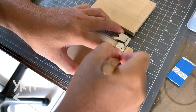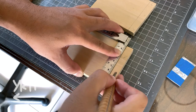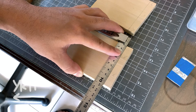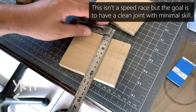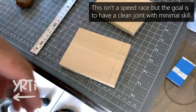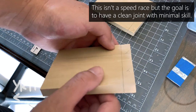After marking where to cut off, I finally use a marking knife to square only on the fingers where I cut off. If you are okay with knife lines on the final product, you actually don't need a pencil to begin with. I take time on the marking process because I believe marking is the most important process when it comes to a joint. Unless it's accurate, no matter how well you cut to the lines, the joint won't fit tight.